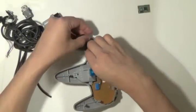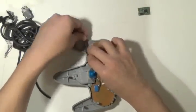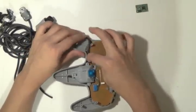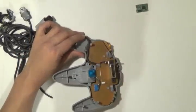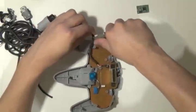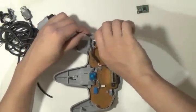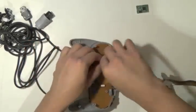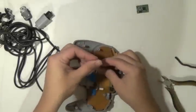Now that you've got that done, we're going to run the wires like this — from the connector on the board to the left and then straight up to the chip, but leaving enough for strain relief on the wires themselves. Once you've figured out the length, you can cut it. Give yourself plenty of room, give yourself plenty of wire. You could always have more wire than less. Then cut it and strip it.